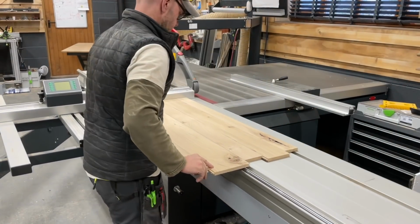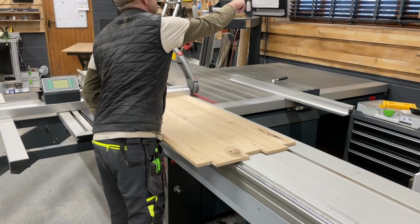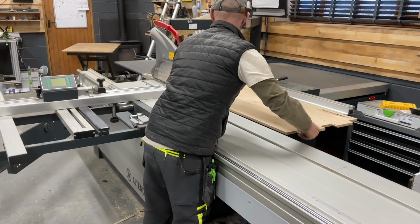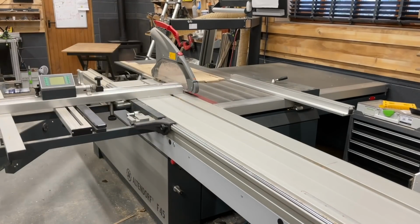So I didn't show it on the video, but as you can see, I've actually glued these panels up. I know it's not traditional, and I know people can ask about expansion, but I've not found it a problem where I live, with the kind of movement we're going to get. And don't forget, I'm going to pour resin on the back of these panels later in the video, so I need it as watertight a joint as possible.